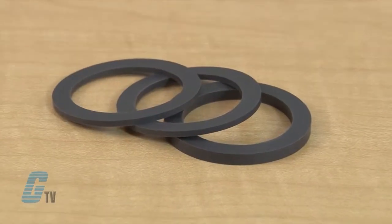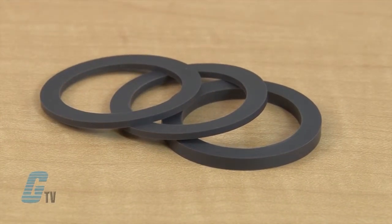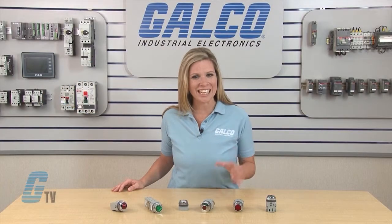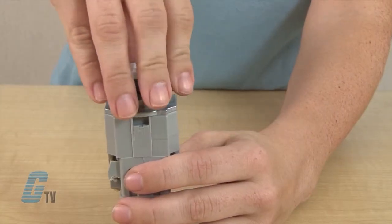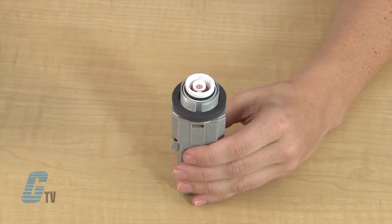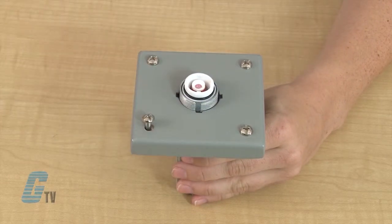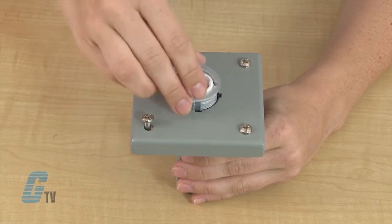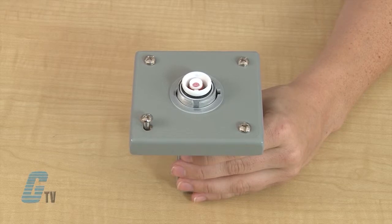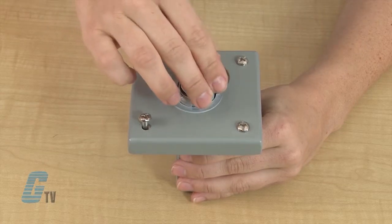The TW TD Series comes with several waterproof gaskets that can be combined for a dimension approximately equal to panel thickness. The waterproof gaskets are in place on the threaded base before placing on the panel. I can place the operator in the panel or enclosure intended for my push button. The plastic trim washer or a nameplate can then be placed over the threaded base, and then the metal thrust washer is placed on next.